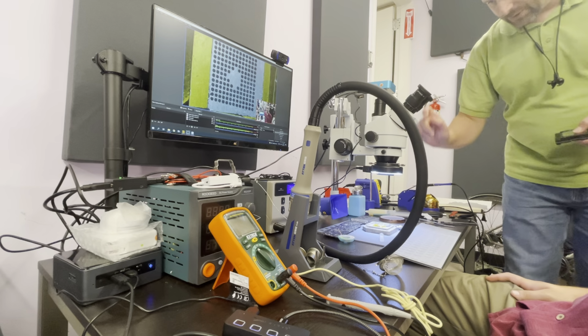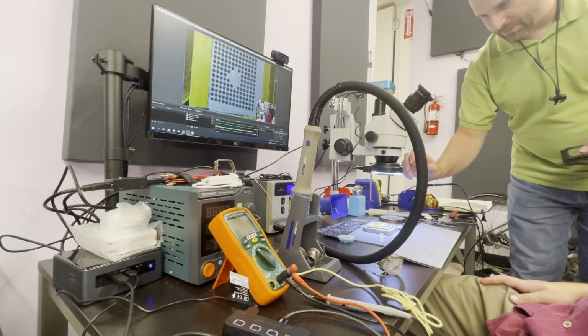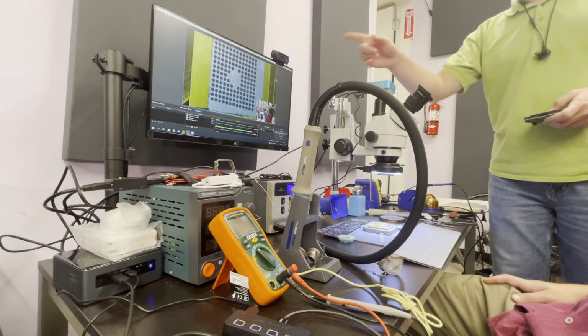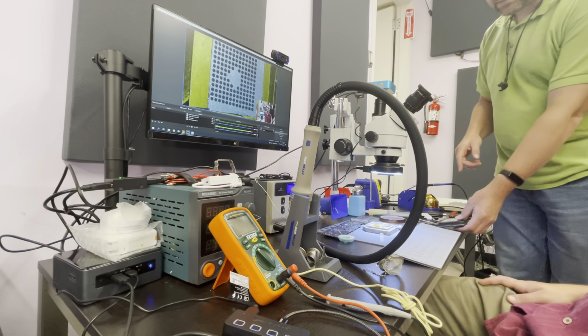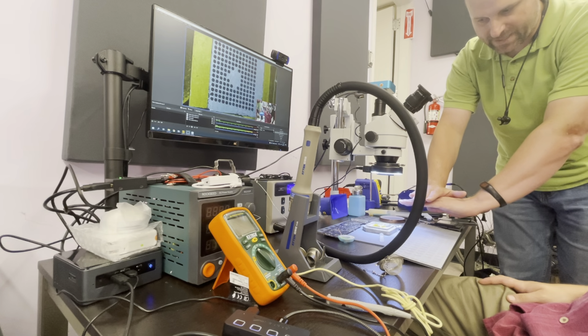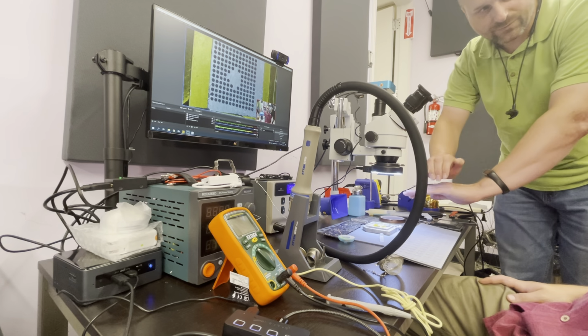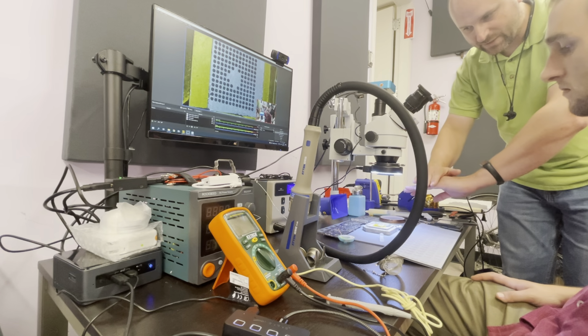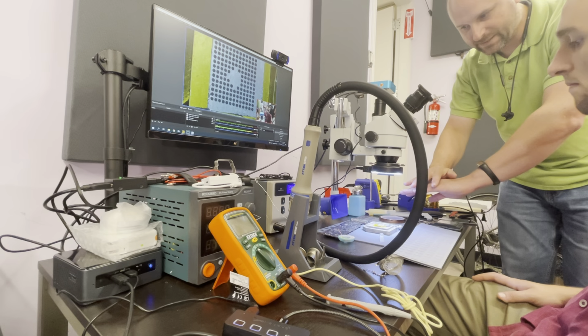This is weird when you see it. What you're going to do is start heating it far away. Let it heat up. As you get closer, be watching it through here because you can't tell on the screen. You're going to see it start bubbling a little bit, and then you're going to see some of the solder paste puff out of the hole. As soon as you see that, move back just a little bit, and maintain that balance to where it's not puffing, but it's bubbling and sizzling, and all of a sudden it'll all melt.